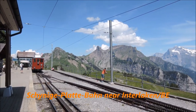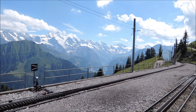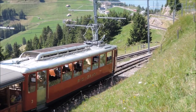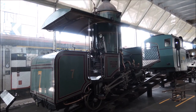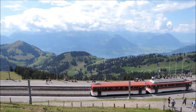This whole topic about how and why to build a rack railway is a good idea for a future video — you can tell me in the comments whether you're interested. Pure rack locomotives like the one from the Vitznau-Rigi Railway don't need a second steam engine to power the normal wheels, as they are driven by the cogwheel at all times. The Vitznau-Rigi Railway was the first rack railway in Europe and the second in the world, opening only shortly after the Mount Washington Cog Railway in America in 1871. Back then the engineers were so concerned about the water level dropping below the crown sheet of the firebox that they fitted the first rack locomotives with vertical boilers to reduce the risk of boiler explosions. And while a vertical boiler locomotive is on static display at the Mount Washington Cog Railway, this one is scheduled to return to Vitznau in 2021 to push trains up to the Rigi Mountain once again.